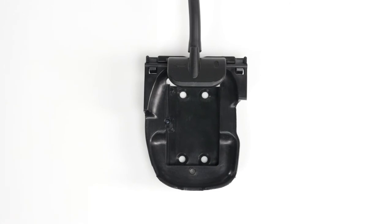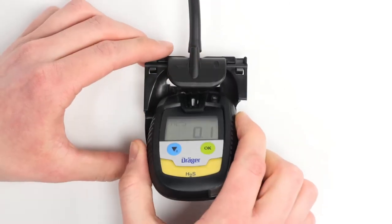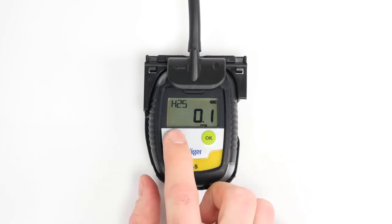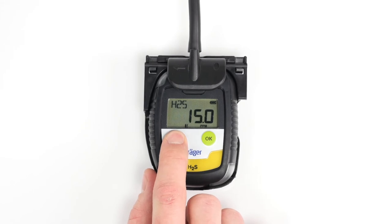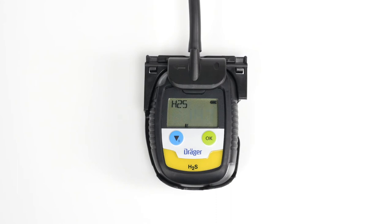The sensitivity calibration serves to calibrate the sensors to a preset gas concentration. Raise the clip on the pack, attach the calibration adapter, and connect it to the test gas cylinder. Press the menu button to enter the menu — the icon for span calibration will start flashing. Confirm with OK to start the sensitivity calibration. Once the calibration icon begins to flash, you can set the calibration concentration using the blue menu button to adjust and the green OK button to confirm. Then expose the device to a gas flow until the measured value remains constant, and press OK.